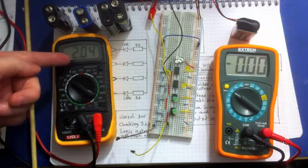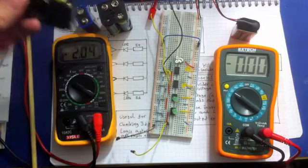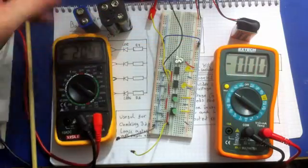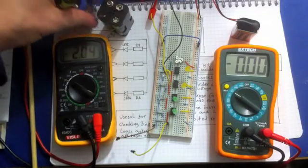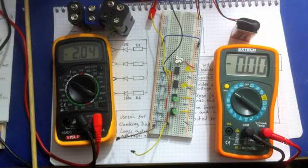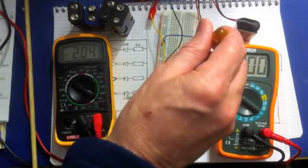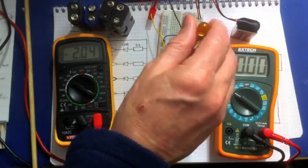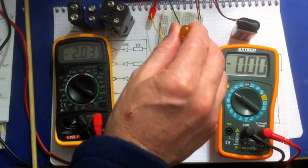You see it's showing 2.04 at the moment, and this voltmeter is just going to be used to find out what the voltages are on these test cells that we're going to test, to see how the LEDs respond to them. So I just want to show you how you can adjust the resolution on this. Here I've got 2.04, but with this 100k potentiometer we can change that, so hopefully you'll be able to see the change on that.